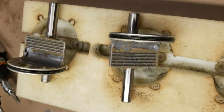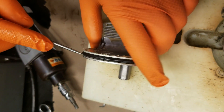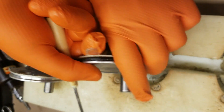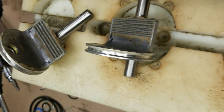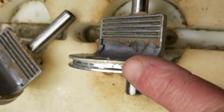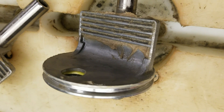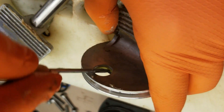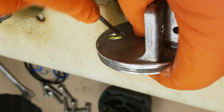Now we want to remove the O-rings from the pistons and clean them. We'll remove the main O-ring off of the piston using a pick or small screwdriver, and do the second one the same way. Once those are removed, clean the O-ring grooves where the O-ring sits — make sure those are clean. The teeth where the piston rides on the pinion or output shaft also need attention. There's also an O-ring and a guide band inside the hole — they'll need to be removed.